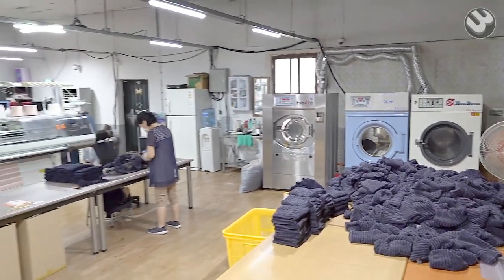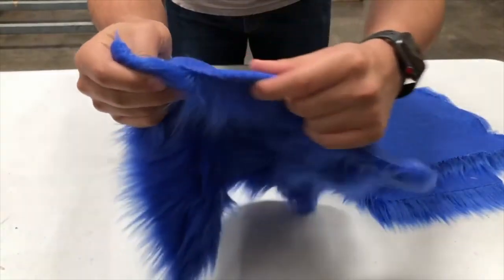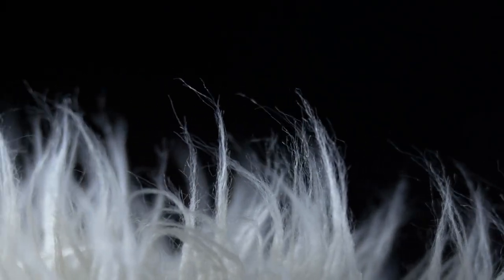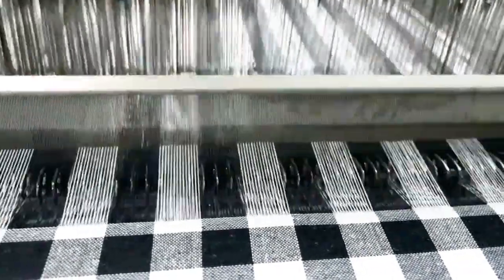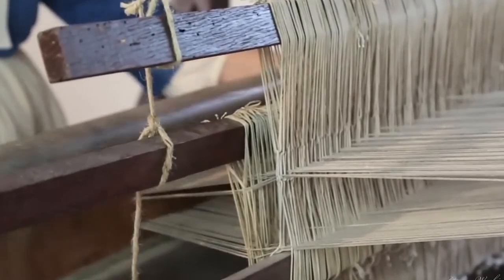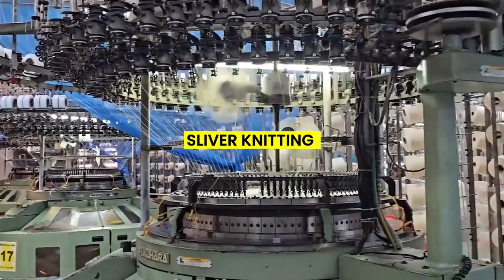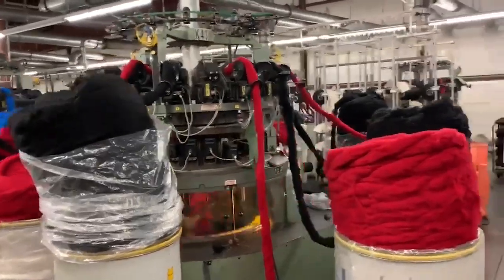In the manufacturing process of fake fur, the backing plays a vital role in providing structure to the garment. The backing, typically made of cotton or wool, is cut according to the design of the garment and sent to the next phase of production for fiber attachment. Four different techniques are used to convert the fibers and backing into a garment. The first method is weaving, where the fibers are looped through and interlaced with the backing fabric. Though slow, it allows for a broad range of cloth shapes. Another technique, tufting, is similar to weaving but produces garments much faster. Circular loop knitting and sliver knitting are also used. Sliver knitting is the most economical and quickest of all techniques and is widely used by manufacturers.